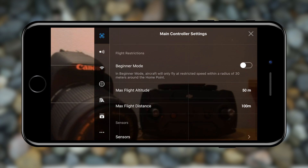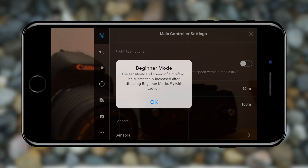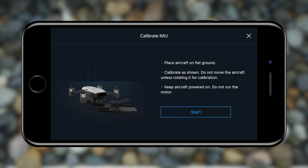If you're new to flying, I suggest giving beginner mode a try — you can activate it from the next setting. Beginner mode slows down the drone's speed and limits the range to 30 meters around the home point, acting like a geofence until you get more comfortable. Do yourself a huge favor and turn on this feature for at least a few flights. The next section is sensors, where you can see the IMU and compass with calibrate buttons. I like to calibrate when I go to a new location and fly for the first time — the process walks you through a series of instructions.